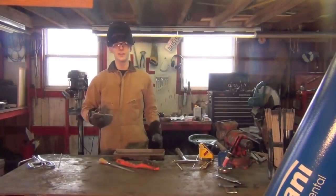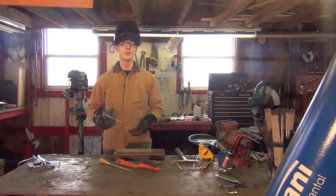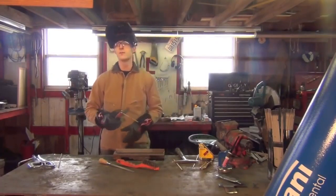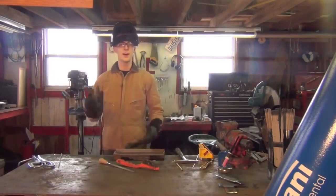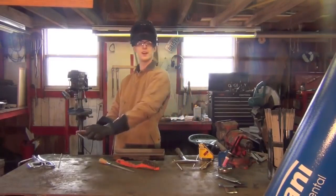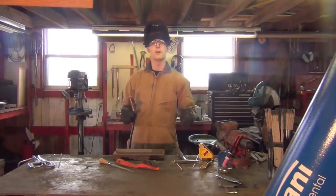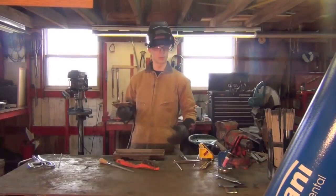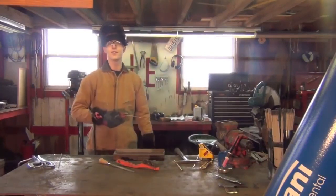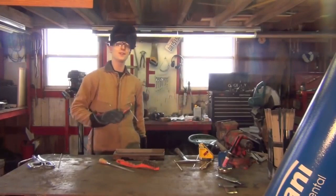Using the best method will cut down on your probability of putting down an accidental arc strike and making your piece look ugly. It'll save you a lot of electrodes because you won't risk damaging the flux. What I like to do is when I'm working on a project, I won't re-strike any 7018s — I'll just make a pile of the ones that need to be re-struck, then file them all down at once and do the last quarter of the project with the filed smooth 7018s. Hopefully these tips will help you out. Thanks for watching — don't forget to comment and subscribe for more.